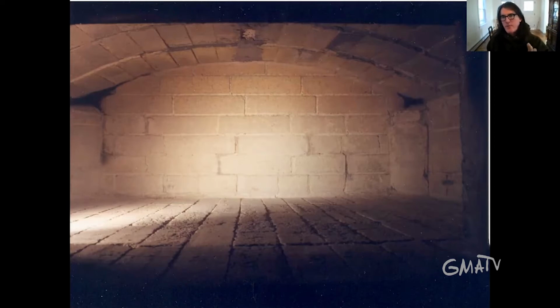At this point, we can say a few things about heat saturation. Ideally, that thermal mass, however much you have, is thoroughly saturated with heat. So if it's 600 degrees on the facing of the brick that we can see, it's 600 degrees on the side that we can't see, because that's our battery. It's fully charged. And as we bake and cook in this environment, we're going to take some of that, but the heat from the outer part of the masonry will migrate in and it'll recover.